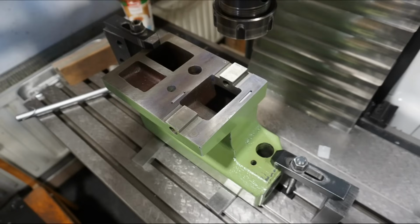So you see that deep hole starts here and ends at this transfer hole. So then we have this transfer pocket that delivers oil to the bottom piece of the tailstock, regardless of how they are adjusted in terms of taper turning. Also, the second oil transfer pocket here, the hole supplying it with oil from the outside starts here and joins the transfer hole here.